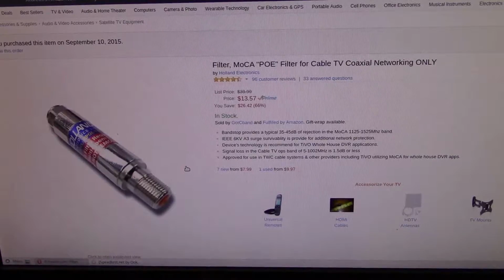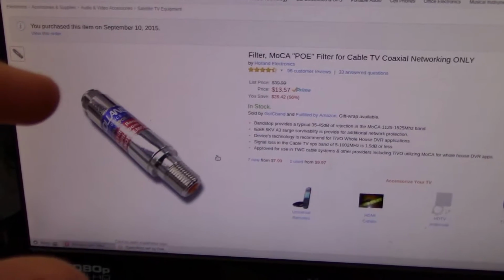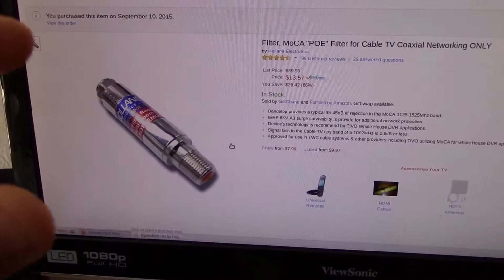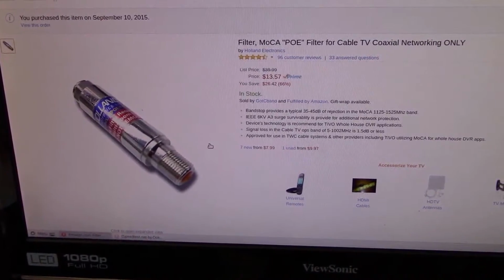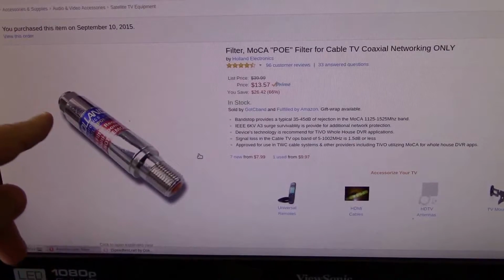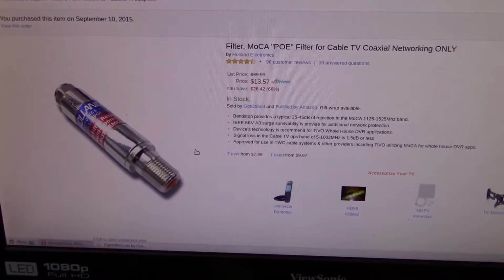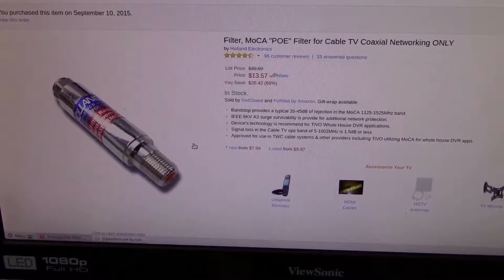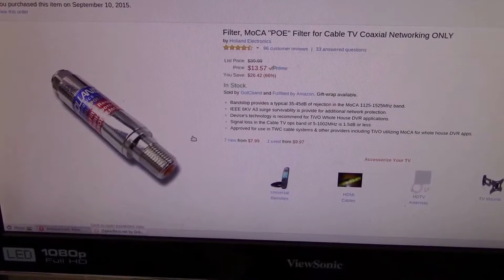Most of them are pretty much standard stuff. I use the Type F insulated connectors that you get the little tool and you pinch them together. Those work good. I use them with quad shield cable, and I always make sure all the screw connections are tight. Even something like this, just make sure all those are tight. They make a tool that will torque them to 20 to 30 pounds, which the cable companies use when putting these in, and you can tighten them up.